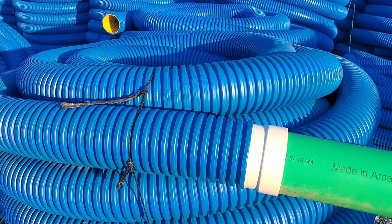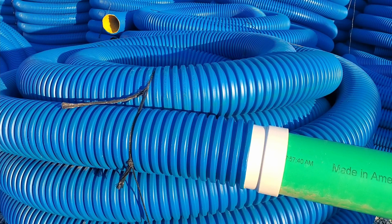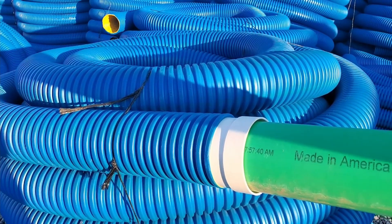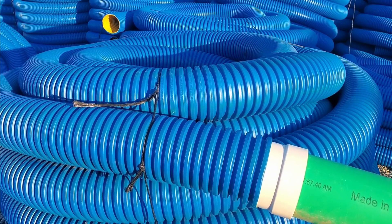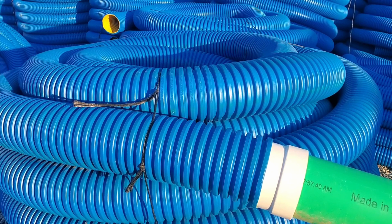So those are our two go-to couplers. When connecting PVC fittings like a pop-up emitter to corrugated, use the cone because you want to be able to take it apart. If it's anything you ever want to disassemble, use the cone — it works best in a pop-up emitter or similar fitting. I love the barbed fitting for connecting PVC schedule 40 pipe to corrugated — four-inch PVC to four-inch corrugated. It ain't coming apart; it's a forever connection and you've got to cut it off to remove it. Hope this helped!